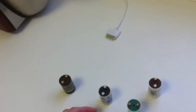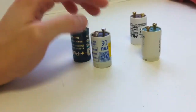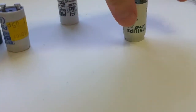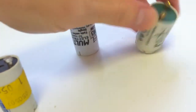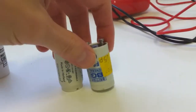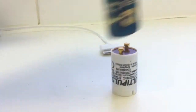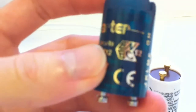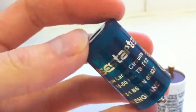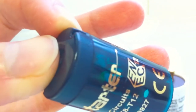So here are some starters — just fluorescent lamp starters. These two here are your traditional starters that you'll find in most fluorescent lamps. These ones here are electronic starters, and this one here has a transparent body. You can see on the camera it actually has a circuit board in there with some components — you can see some transistors and capacitors in them.